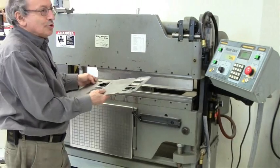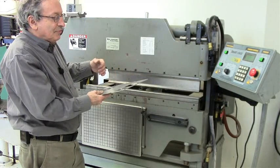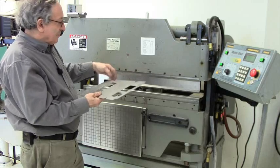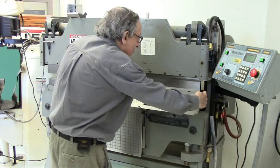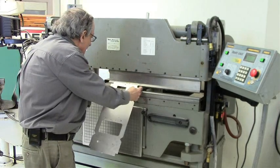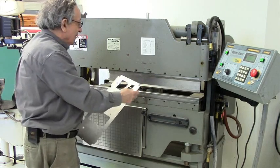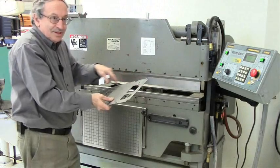Before deciding what to bend first — should I bend the two long lines first or the short ones? — I look at which tooling I have, because once I bend one pair I need a tool which fits in between. If I bend those edges first I need a tool this long to fit in between, and I have one a bit shorter. If I bend these first I need a tool this long, and the one I have is a bit too long. So I'm better off bending the short ones first, because this tool is closer to the length of the unit.